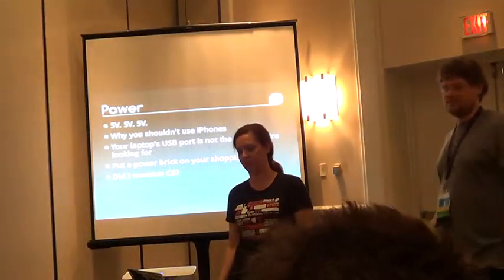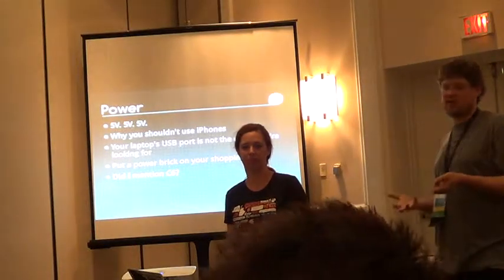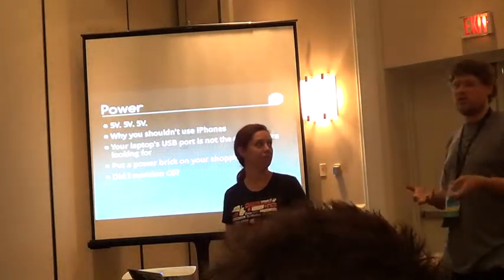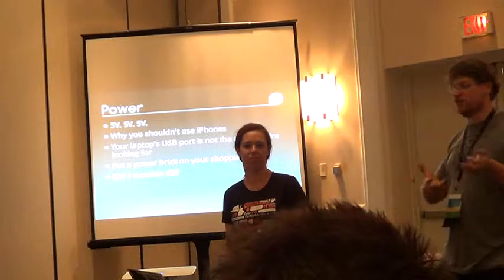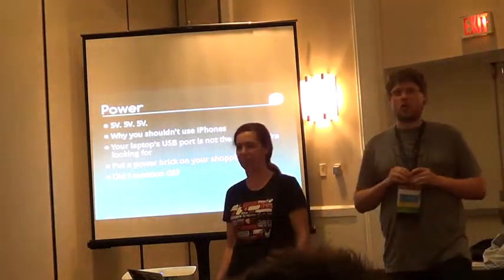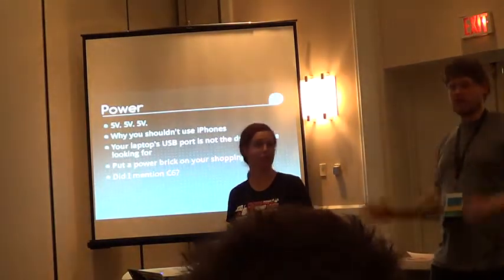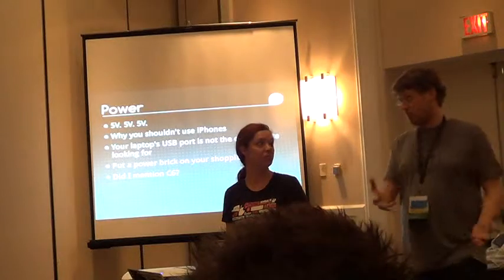It's probably crap. Because your phone doesn't require clean 5-volt 1-amp to charge its battery. And they know this, so they're not going to give you a nice free charger that has this guaranteed reliable power, because it just means that your battery will charge faster and no one will care. The Pi just goes crazy because it's not a battery, it's an actual computing object.